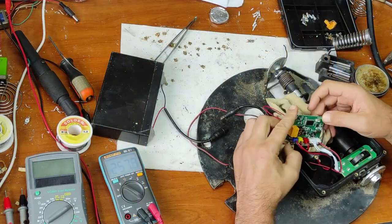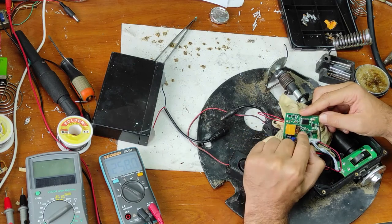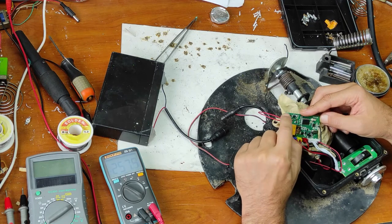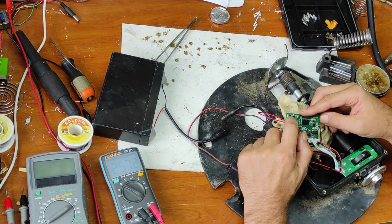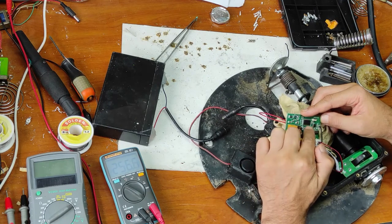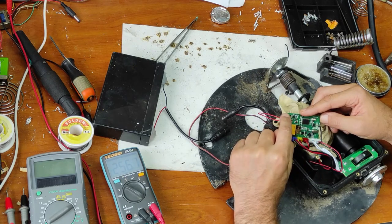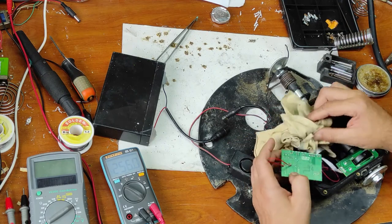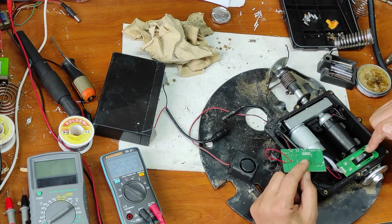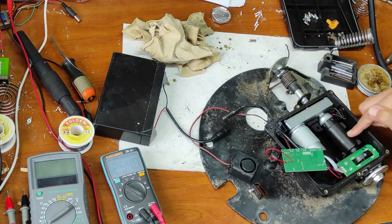I made a lot of tests and it's still not working. I replaced these two relays with one another and still not working. I checked this shunt resistor to see if it's broken and making a fake overcurrent signal to the microcontroller — but this is good. I believe that the problem is with this optocoupler.